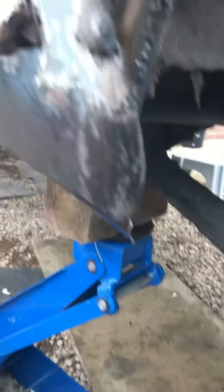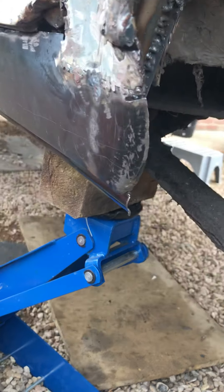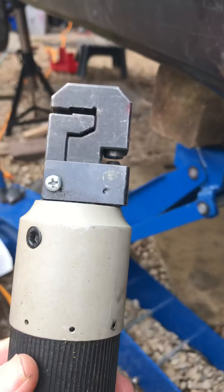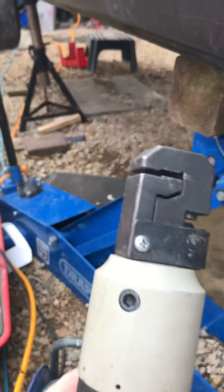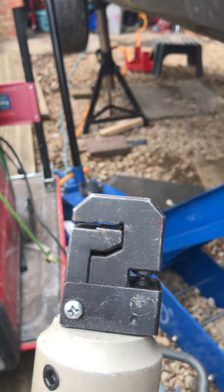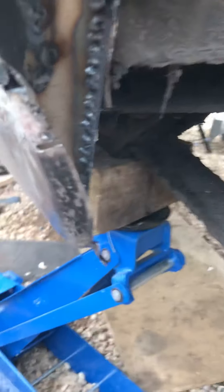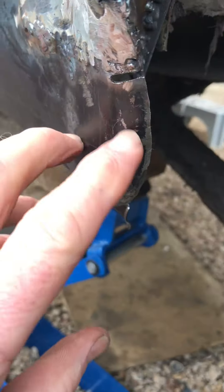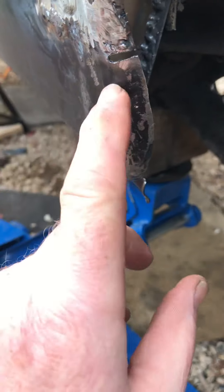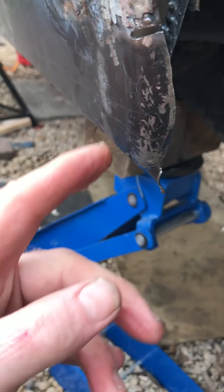There are probably lots of ways to do it — they use special tools in the workshop with round wheels under pressure. I'm using these pliers here, which create a lip for welding. It's attached to the compressor and you can see it shuts and creates a flange in the metal. I created a flange all the way around here to give an even flange, then using pliers simply bent it round, using that lip as a guide created by the flange tool.